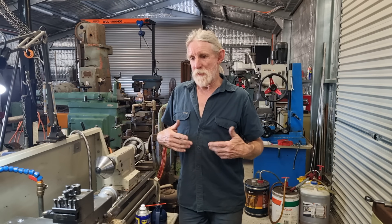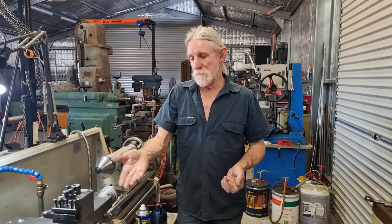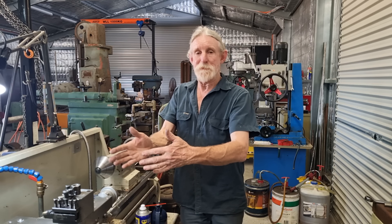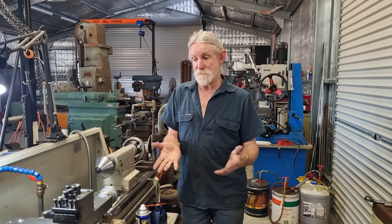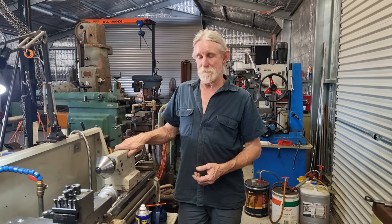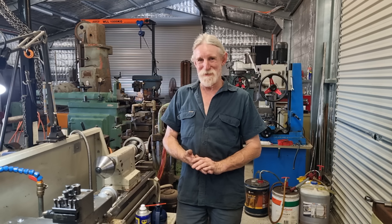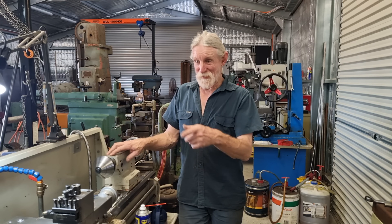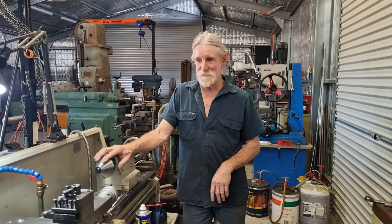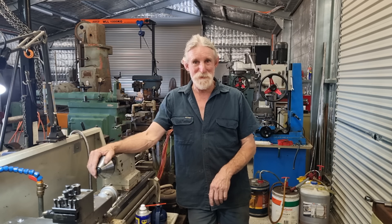From what I gather here in Australia and how I was brought up, we normally leave our compound angled parallel with the bed. I've seen the American style to leave it angled around - whether that's so it remains set up for screw cutting or to give extra clearance for the tailstock, either or. Anyway, I thought I'd slip this one in - and that is a common thread too, 12 TPI 2¾ inch, common as anything. Cheers, thanks for watching and probably see you in the next video.